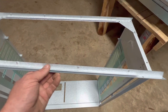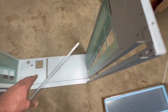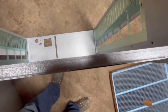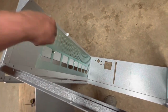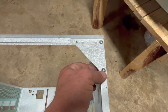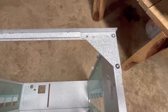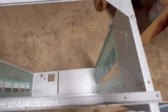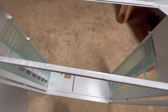This is your bottom piece — top, bottom — you've got to face it the right direction. See how the groove is right here? It matches that groove there — that's for the piece to slide in. There's a plastic piece, and when you put these screws in, they're all the same screws: a nut and a Phillips head. Do not tighten them up. I'm using a small impact to put them in quicker, but if you tighten them up the threads gall and they're hard to get out. Leave them loose until you get it squared up, then tighten them.